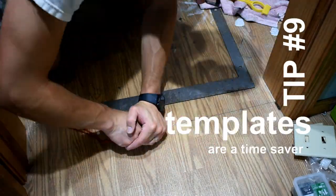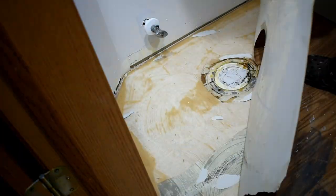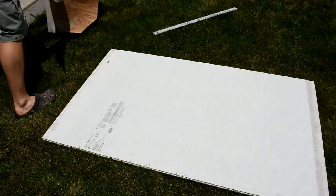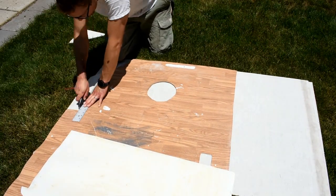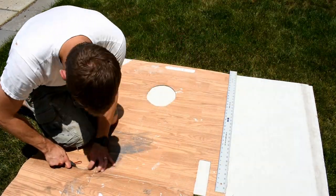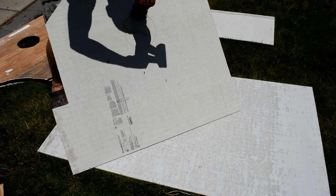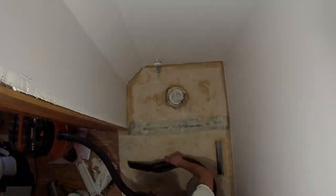Tip number nine: when you are doing any kind of flooring and need to put another subfloor or underlayment in, use a template. In this case I was removing a laminate, so I was able to retain that piece of laminate as a template to cut the underlayment for the tile I was putting in. It saves you a lot of time and measuring and makes much more accurate cuts. Just like with drywall, you can cut cement board by scoring it with a knife and then breaking it, or use a reciprocating saw to cut out any holes. Make sure your surfaces are clean before you put an underlayment down so everything lays flush, and make sure you're driving the screw heads fully under the surface of the board.